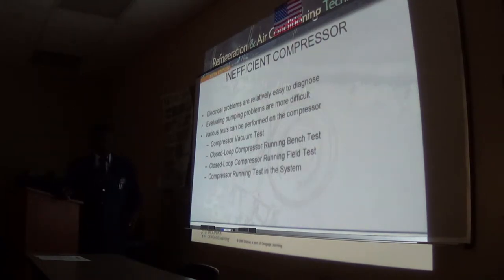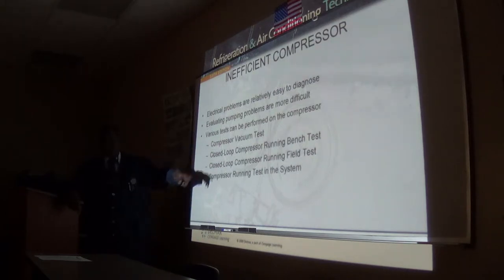So you just let it go with nothing in it? Yeah, nothing in it, just hook the suction and discharge. It's like a closed loop you're making. Okay, but no condenser unit, no evaporator unit, no metering device. No, just the pipe. Well, I ain't taking out no compressor to do that. If the other test takes me there, then this is good enough for the field.